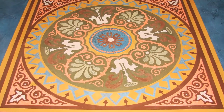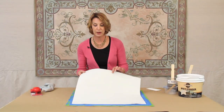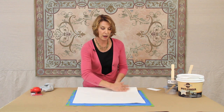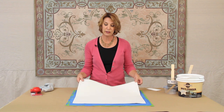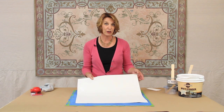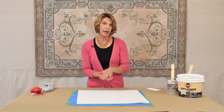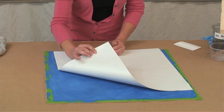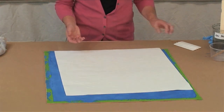It really gives you a lot more options artistically and creatively. The vinyl is cut and then the pattern area is generally removed, then we put on the transfer tape — the translucent tape on top that holds the pattern in place until we get it transferred onto the surface. So there are three layers: the transfer tape, the vinyl in the middle, and on the back there's what we call backing paper, which is like a heavy waxed paper protecting the adhesive side of the vinyl.